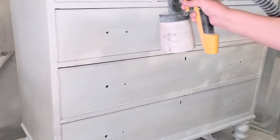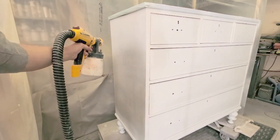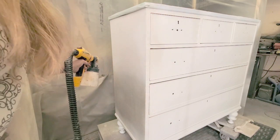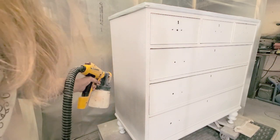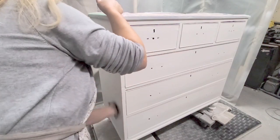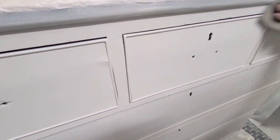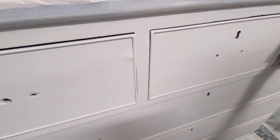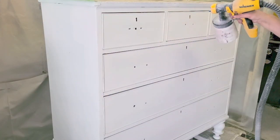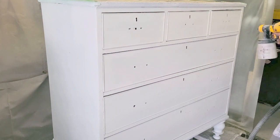Here I'm showing you where the bleed-through was on the first coat — you can see it on the side as well, it's sort of a beige color. I just wanted to show you how the Kilz spray covered it up. You can see the front is completely clean and I was just so happy — it completely changed my priming work life. After two coats I sanded with 600 grit sandpaper and it was so smooth. I sanded the front with a worn-down 220 sanding pad, then wiped it with a cloth, wearing my mask the whole time.